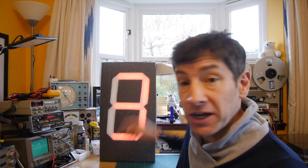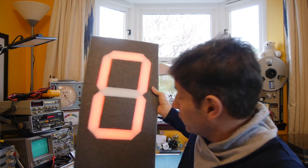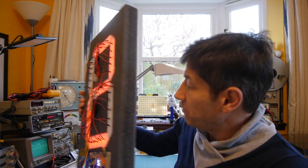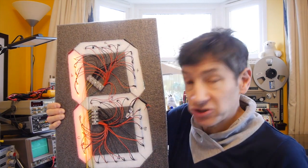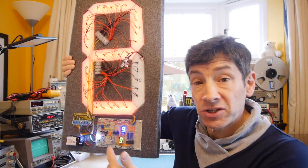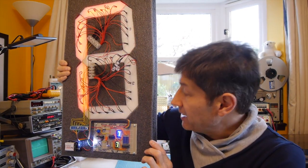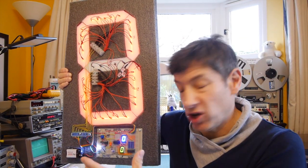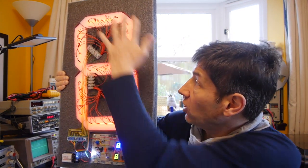So let's have a quick look at the finished item, and then I'll show you what electronics was needed to make it work, and also how I cut out this foam to make the actual shape of the display. I've got two different colors of foam here. And on the back, I've got LEDs going into the segments - I'll show you some close ups of this. Down here I've got the circuit board I built that has the chips needed to count and then feed the right number to the seven segment display. And because I'm using a lot of LEDs, I need quite a bit more current, so I've got a Darlington driver that will increase the current and light the LEDs in the display.